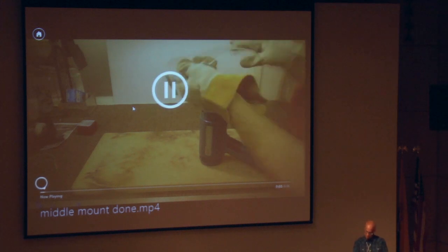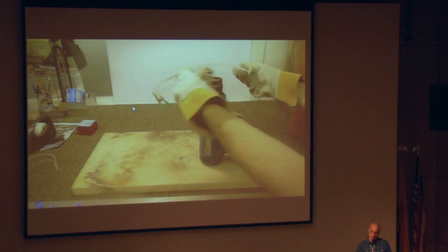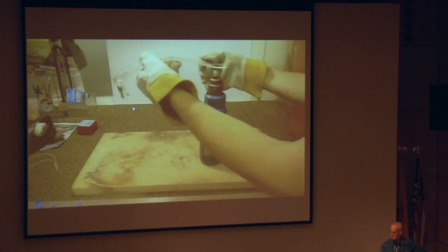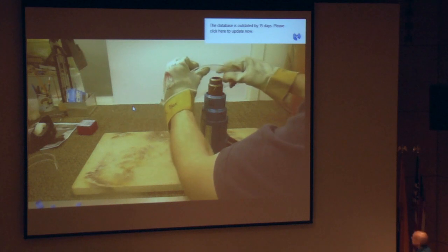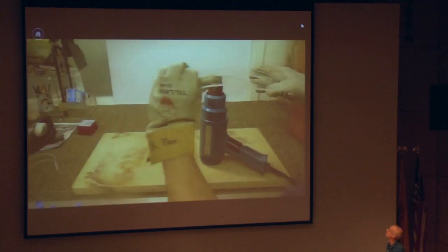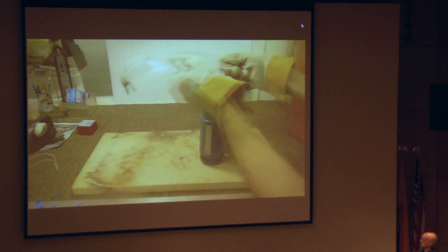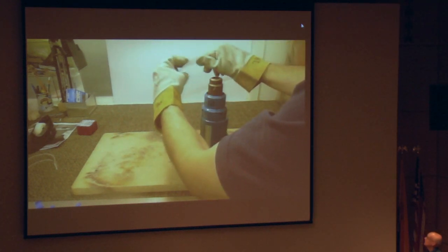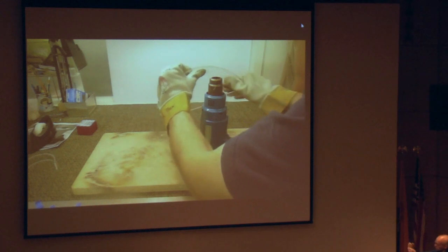Here you can see I added a clip to hold those two ends together. Just pick one side and work your way around the form, heating and adjusting as needed. It's actually kind of fun to mold this stuff. This is probably about a nine-minute bend that I pushed down to around three minutes, so it bounces around a little bit. You are really stretching and forming as you go around — it's not just bending in a singular plane, but in both planes.